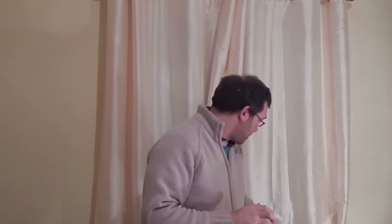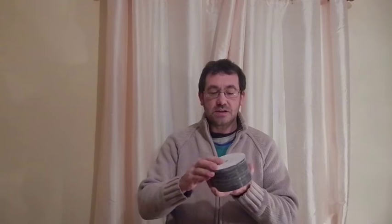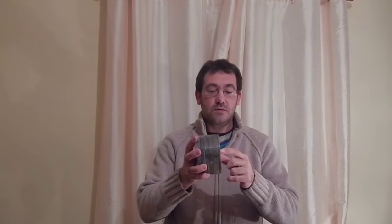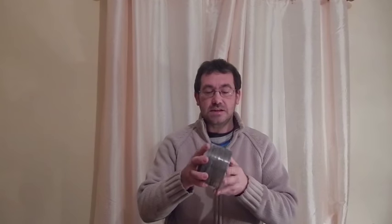One was the gluing up process, which I will do a short video to show you how to glue them up. Now, when you've glued the blank up, I have a big one here. When you've glued the blank up, what I do is I look around the sides. If there is any sign of any slight gap, because some of these CDs have a little dip in the center, or a raised part in the center, then just fill it with CA glue.